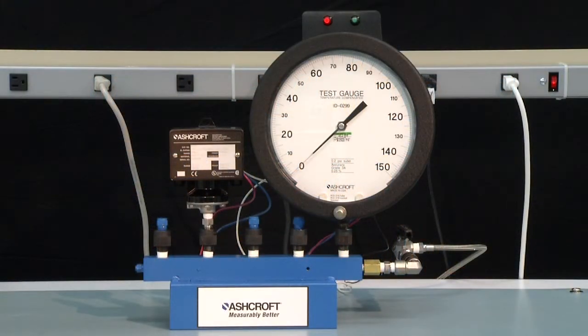To measure a decreasing setpoint, start at 0 PSI and increase the pressure to the full range — in this case 100 PSI. The light will have switched from red to green as the pressure is raised. Then lower the pressure to the reset point; the light will turn red indicating the normally closed contact has closed. For this switch it is 20 PSI. To measure the deadband, slowly increase the pressure until the light turns green indicating the normally open contact has closed — this is 22 PSI. Therefore the deadband is 22 minus 20, or 2 PSI.